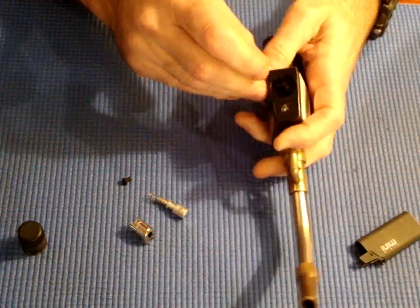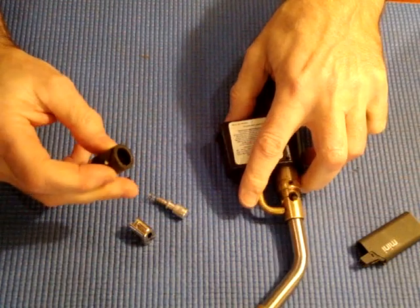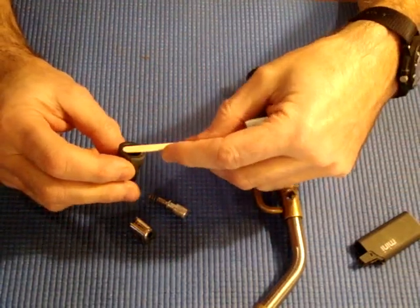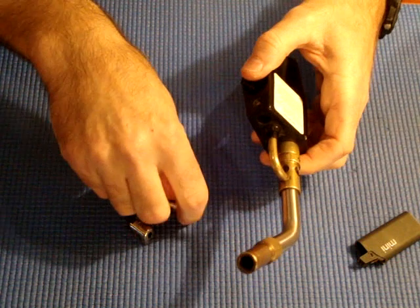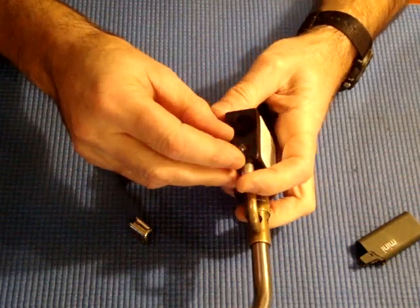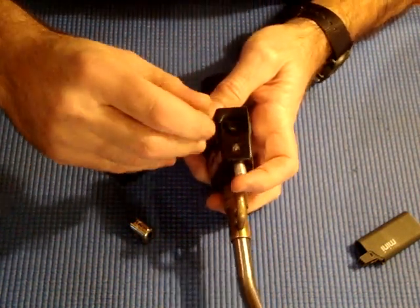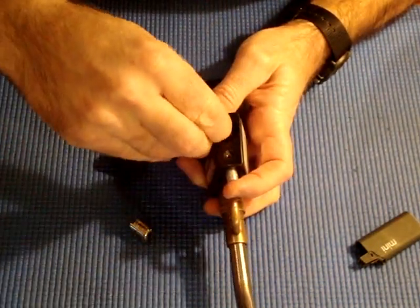What I did — I tried this before and the trigger didn't have enough length inside. So I took a piece of wooden stir stick, measured it across, squared both ends, and slid it right down to the bottom. Now put your hold-down button in the hole and line up your piezo electric inside.